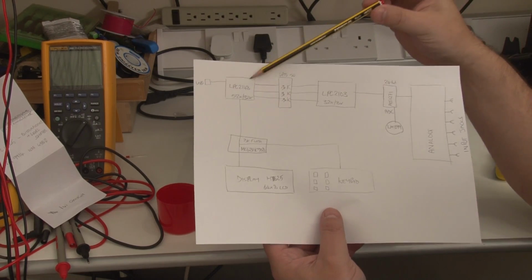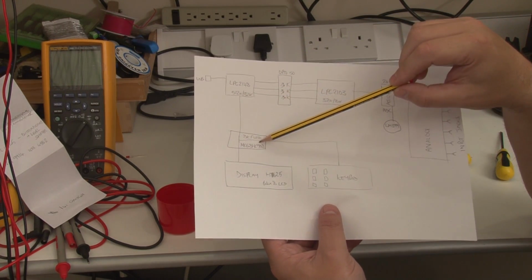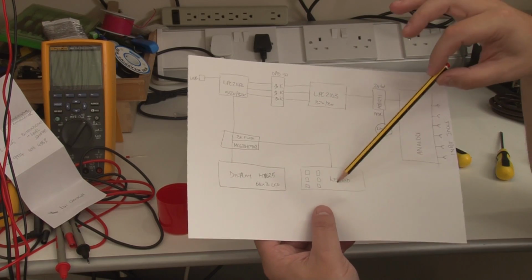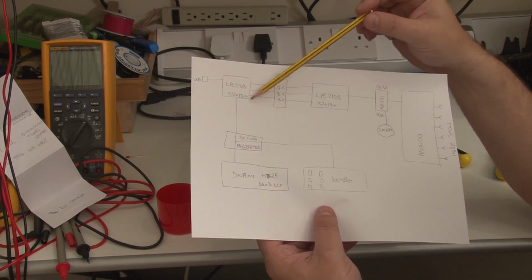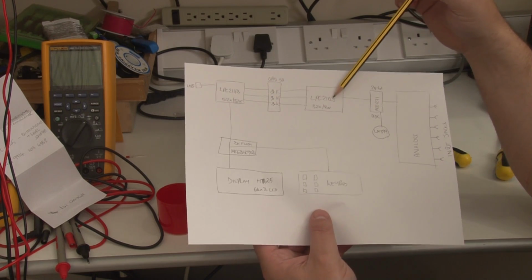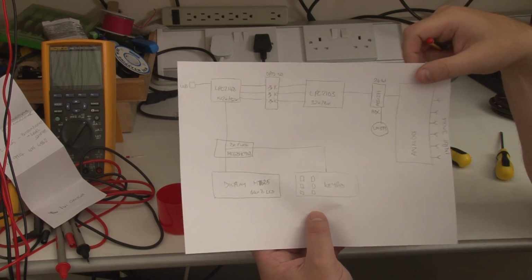just to remind ourselves. So we've got 2 microcontrollers here. We've got the main microcontroller, which is an LPC2148. That's quite a big micro. And that's communicating over serial to a small 68HC908 microcontroller, which is mounted on the front panel. That's obviously controlling the display and the keypad. We've then got full opto isolation and digital communications over to this microcontroller, which is an LPC2103, and that's obviously amongst all the other things dealing with all the relay switching, all of the analog switching, the actual ADC as well, and then obviously all the analog circuitry and the input jacks. So that's the basic architecture of this.